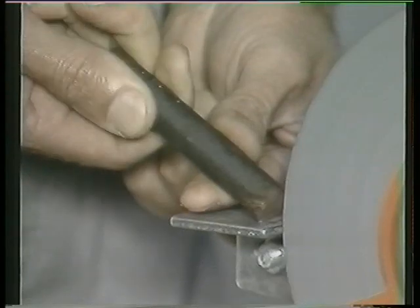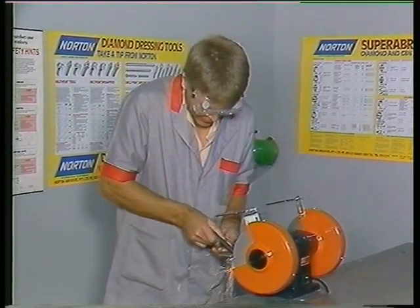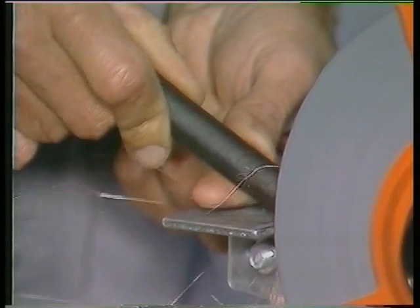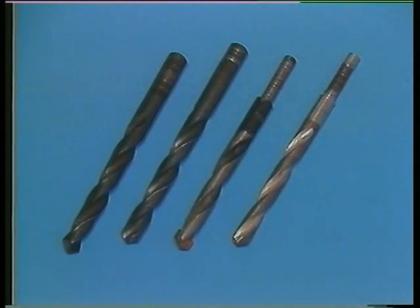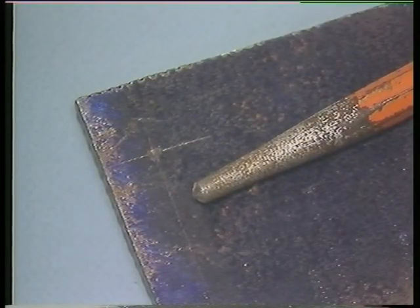The primary purpose of any grinding machine is to shape metal workpieces. Most general engineering workshops will possess at least one bench mounted general purpose type grinding machine. Such a machine is this bench grinder, which with practice can be used for sharpening such items as lathe cutting tips, drill bits, cold chisels, domestic tools and centre punches, to mention but a few applications.